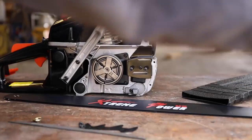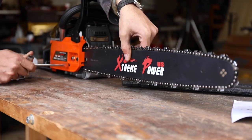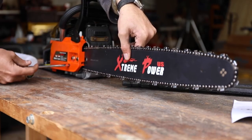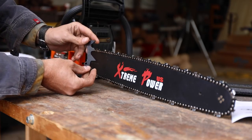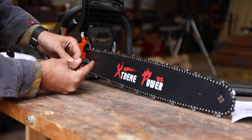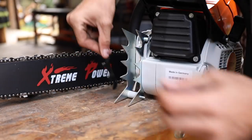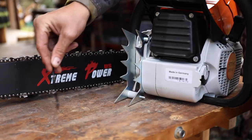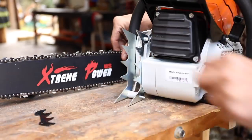Let's put the chain on — we don't want to put it on backwards. That feels pretty chintzy but you can get it tight. We messed up — we've got to put the log dogs on first. Let's compare those to the Stihl's. Not quite the same. I've got to pull the bar back off because I forgot — we need to put those things on first and then we can tighten up the bar and see if it starts.